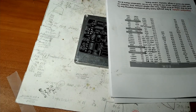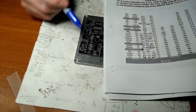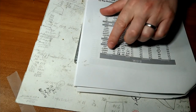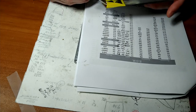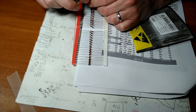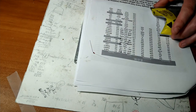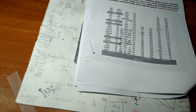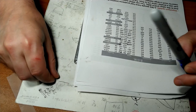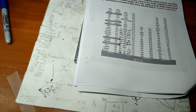All right, so let the fun begin. So, like I said, we want to start with the smallest components first, and that's usually diodes. So let's pull out these diodes, see what they look like. So we need a 1N914, very common diode. If you're going to do this, get yourself a 1,000-pack of these. And as you can see, this is a very teeny tiny little component. So this is definitely a good place to start. Back in the bag. So 1N914, put a little dot next to it, know that we have installed it,